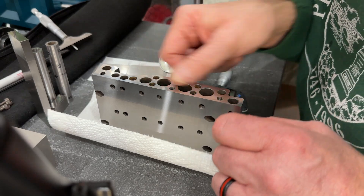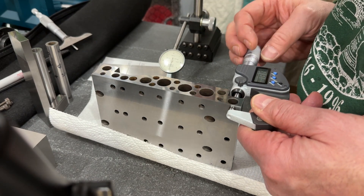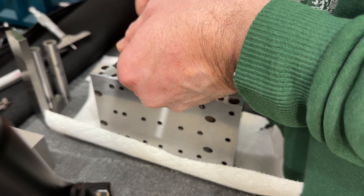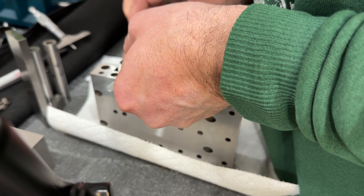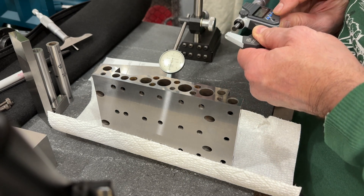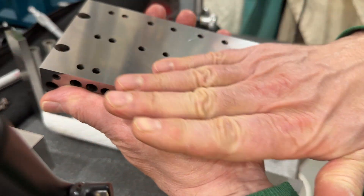We got this thing as dry as we can get it, and we're also letting it equilibrate for temperature. What we're going to do is measure with the micrometer right across the two surfaces carefully. We're going to zero it — okay, this one is zeroed. Now we're going over to the thickness that we just ground, and I'm going to hit the hold button because you're not going to believe me. Yeah, I think we nailed it. What do you think? So according to the micrometer — turning off hold, turning off incremental — we nailed it. Now let's put it down on the surface plate and see what we can get.